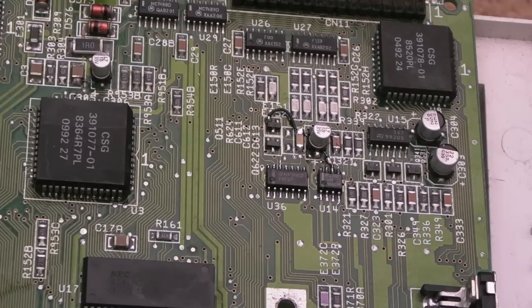But the CPU was trying to boot, and because that area of the board hadn't been reset on the ST, certain things were behaving unexpectedly. They hadn't been put in line with the normal sequence of processing. They were in a spurious state because they hadn't been reset, and that was causing a bus conflict, I think, which is why the data bus looked awful on the ST.